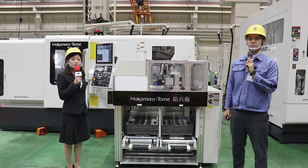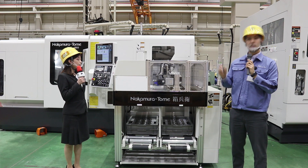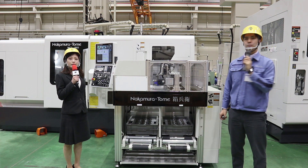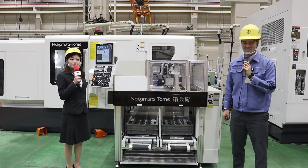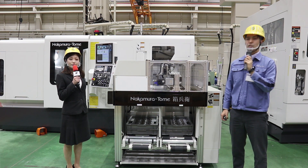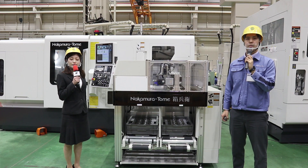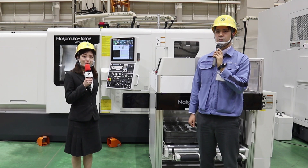The compact loader is attached to the right side of the machine, right? Yes, it is. Since it's attached to the right side, the left side is actually free. So that means you can attach something we are familiar with — we can equip a bar feeder on the left side. One of the advantages is that you can use a bar feeder when using bar material and the compact loader when using slugs. So it can be used flexibly.